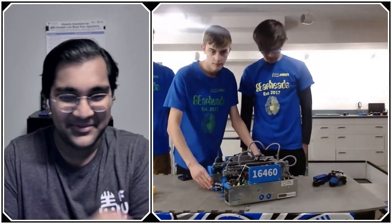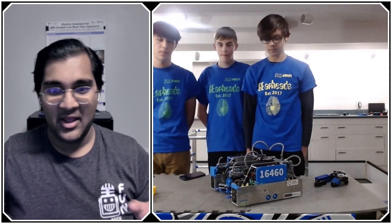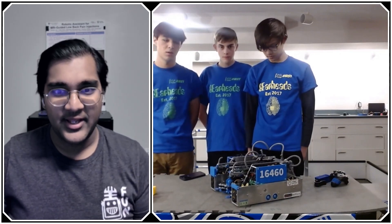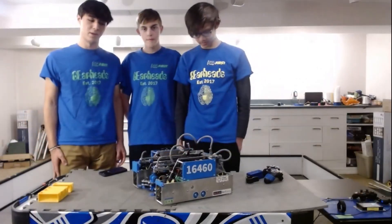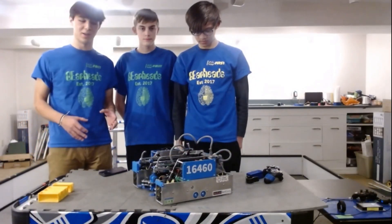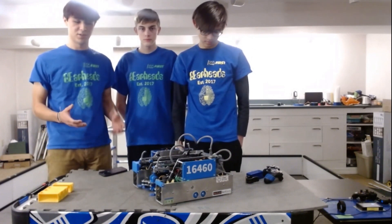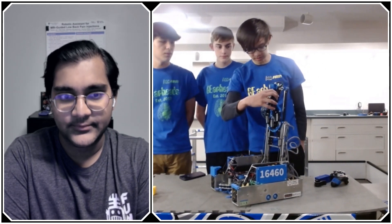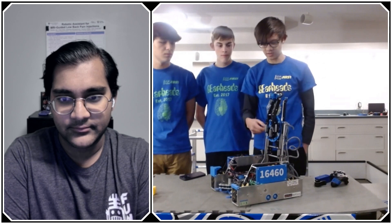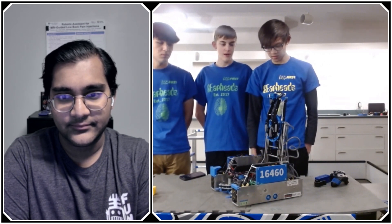That's just really incredible, Gearheads. What changes would you like to make to the robot? We're adding the level three hang, as well as testing different strings for reliability — we're putting heavy torque on the string when lifting blocks quickly. We've been testing different string types. Right now we're using 0.8 millimeter diameter polyethylene string, around 100-pound capacity. We found it keeps tension pretty well once it gets past the initial stretch. We tested Kevlar strings with higher weight capacity but those broke after stretching a bit — they don't stretch as much.